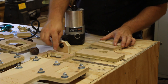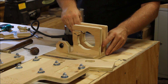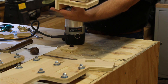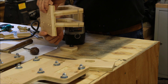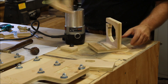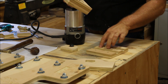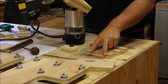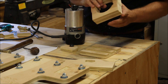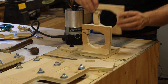Also with these router mounts, if you look at the holes you'll notice they're different, so you could run it one way or the other depending on your needs — that will change your Z height depending on how you bolt it. There are four different holes in the Z-box too, so you can use one set or go up another inch and use the other set. When you're finally ready to glue and screw it on, make sure you put both mounts in the same direction as far as the cutout.